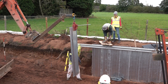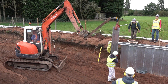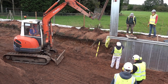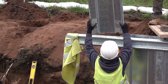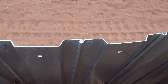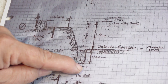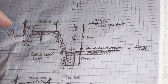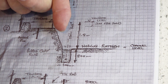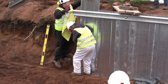It doesn't look as though there's anything on the other side. Basically, what we do is lay a sheet of polythene down the back. What we did was dig a trench through — a cut-off trench. You can see where he's interlocking just below his hand — that's the clutch. One pile clutches into the other and just slides right the way down. Rather than drive them straight into the ground, we dug a trench along the bottom below the pile depth, filled it with clay, and we're driving into that clay, which seals the piles into the bottom of the trench.